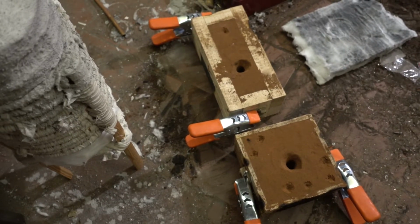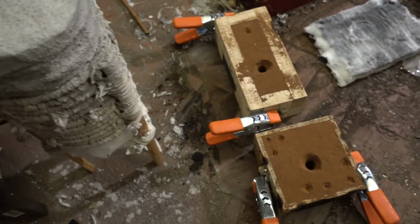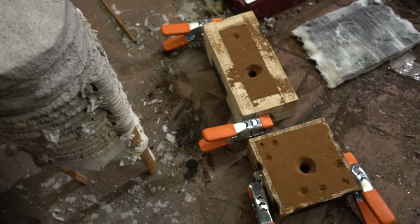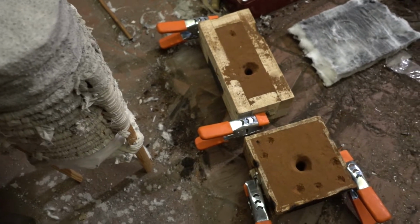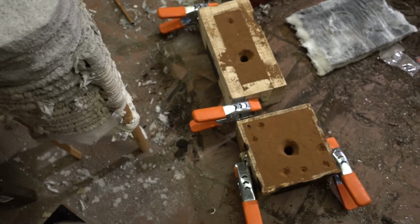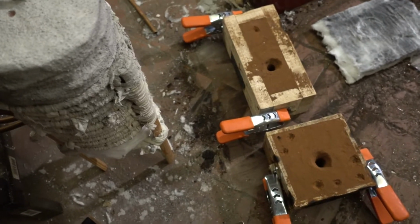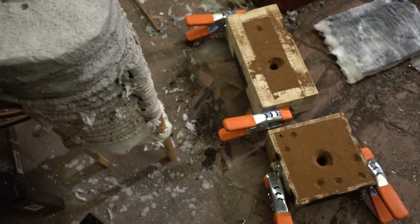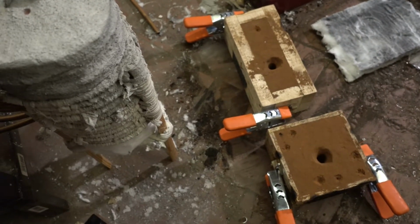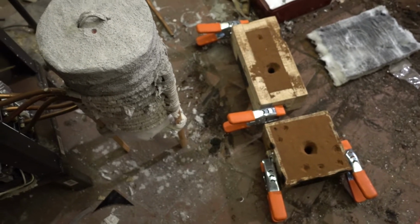If you spill hot material on concrete, you may get a steam explosion, a lot of liquid metal and concrete shrapnel. That's not good. So if you have a concrete floor, you can build some kind of sandbox, fill it with silica sand, and then you're safe. Put your furnace in there and molds, and it's totally fine. But don't do that on concrete floor without protection. Just a disclaimer. I don't want you to get injured.